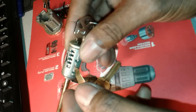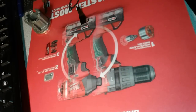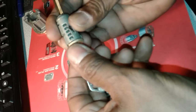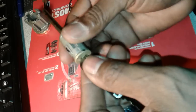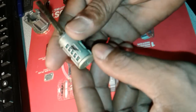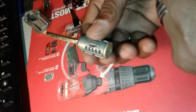To test our tool, we're going to change this lock to a random key and then recreate that key — just like you would in a house with no keys. I went ahead and reset this lock; now the original keys don't work. That's exactly what happens when you run into a house with, say, French doors with double-sided Kwikset smart key deadbolts and 10 or 12 locks to change out. Take one lock off the door and let's recreate a new key.